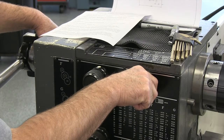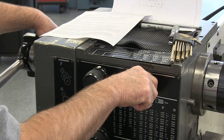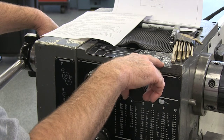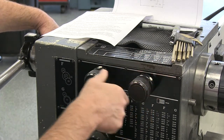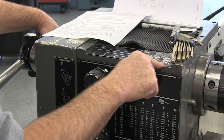Now that we are back at the machine at the headstock, we calculated our RPM value at 133. Our machine's closest available speed to that is 125, and that will be just fine. We're going to make sure that our machine is set for 125 RPM.